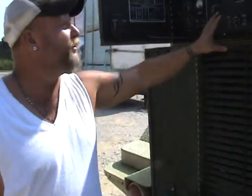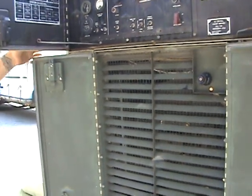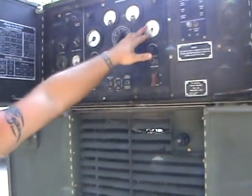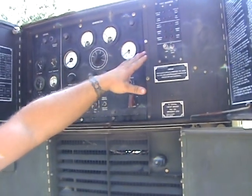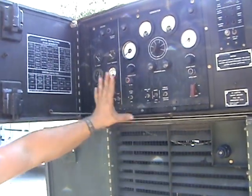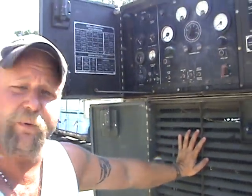Once you've done that, you can adjust your voltage. This unit — generator number two, the lighter color of the two — is very sensitive about over-voltage, so you don't want to exceed much over 230 volts or it'll continually shut off. So 230 volts, 60 cycles; you have your monitoring gauges here and you'll be okay. Remember, these doors remain open for cooling purposes.